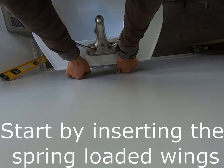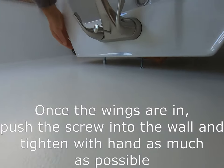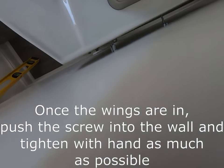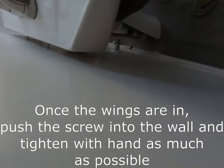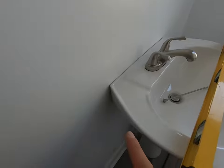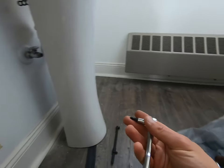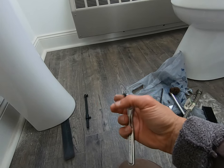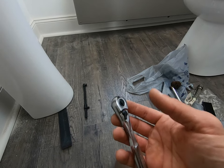This is going to need some doing. Once you've got your sink situated and your toggle bolts in, you screw them in with your fingers as much as you can. It's a tight area, so here is a tip for you — you're going to get into a tough situation. What you'll need is a bit and one of these, a wrench. You put it together and go to town. This is the closest I could get.